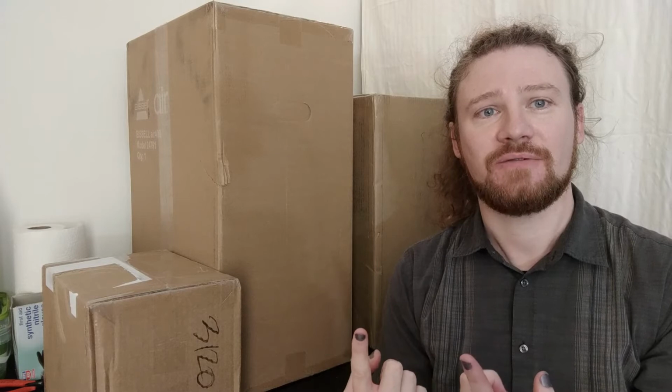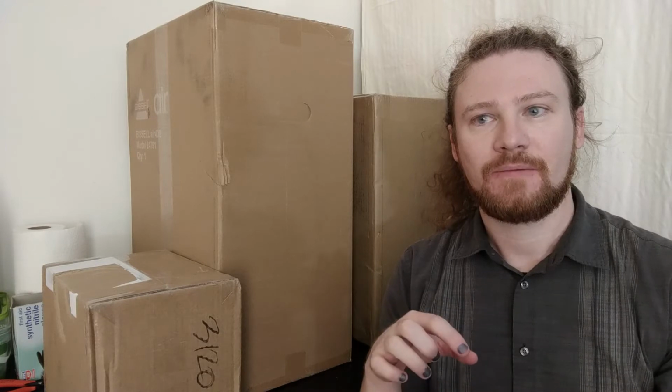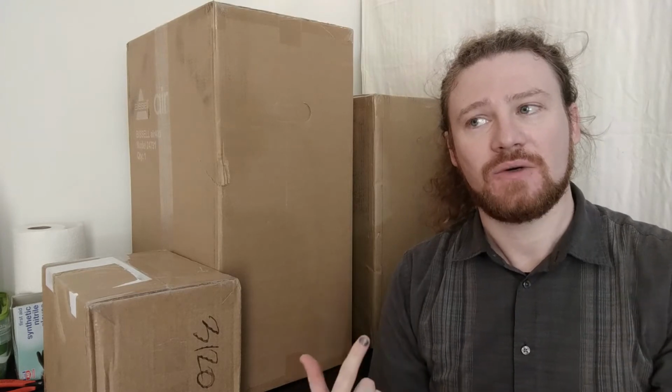So recently on Maker's Muse, I saw a video on masked-SLA printing. Historically, resin-based or SLA printers have been extremely expensive, but a new development is using an ultraviolet light source in the base shining through an LCD screen from something like a smartphone or a tablet. By using images on the screen, it masks off the UV light, which cures the resin in the bath. Thanks to the explosion of smartphones recently, these 3D printers have become pretty accessible for a home user.